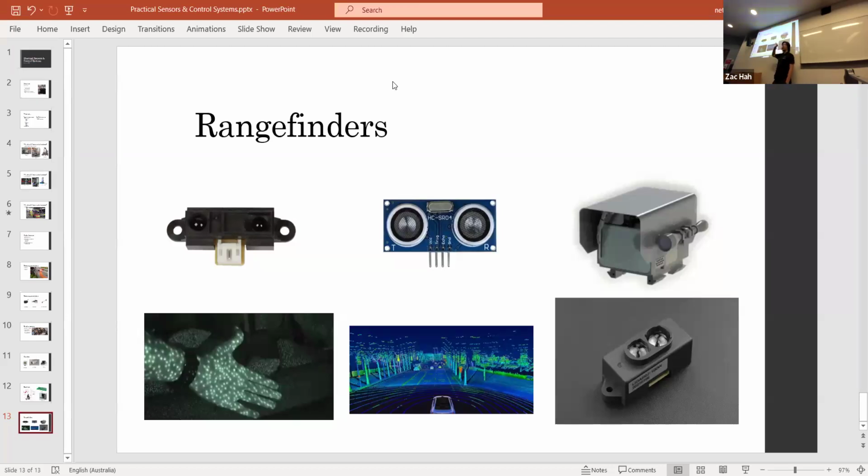Ultrasonic sensors, I said that Project Bucephalus tried it. You get a lot of noise in your data there. So you have to pay a lot of attention to filter that data out. And that noise can change depending on your environment, what kind of material you're pointing at, the humidity of the air, the actual acoustic noise in the environment. It's actually really annoying. The angle that you're facing the wall at matters too. So really, for the speed that you're running an FRC robot at, an ultrasonic sensor is probably not that valuable. LiDAR, not LiDAR, like a time of flight, infrared or visible light.